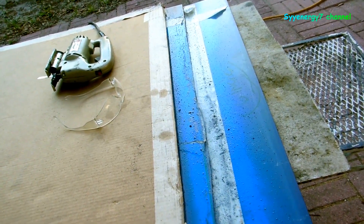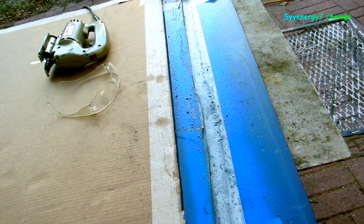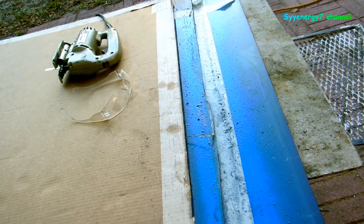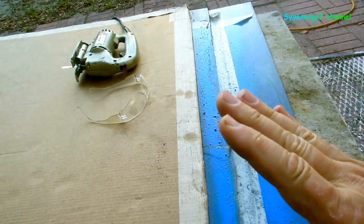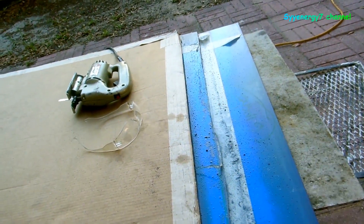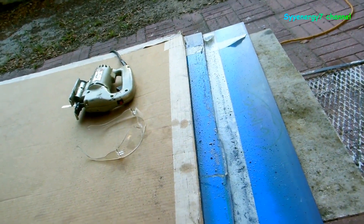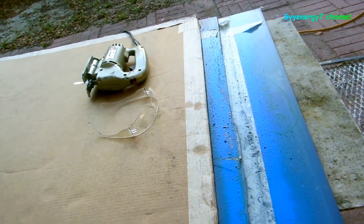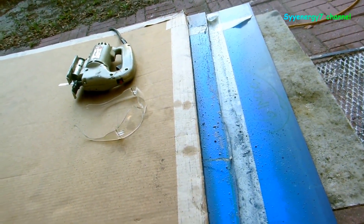This is partly for breaking in, but really it's more for hurricanes. One of your biggest problems with hurricanes - a lot of people don't realize this - if your door blows in, once the envelope of the house is open to the wind, it pushes on the opposite side of the wall, pushes out on the opposite wall, and pushes up on the opposite side of the roof. It just pulls the whole thing over. So you want to make sure your doors can't blow in. An ounce of prevention could be worth a ton of cure.